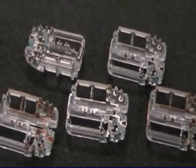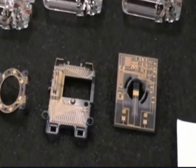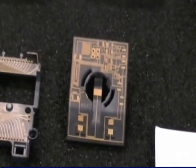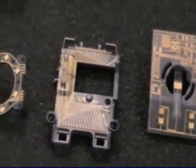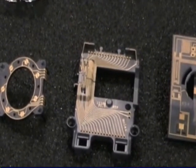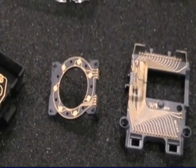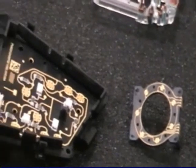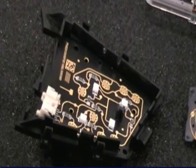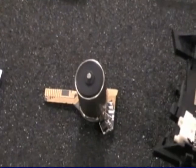As we look closer, we see some other three-dimensional molded interconnects, and these interconnects actually have a top layer of gold, so they look brighter than the insulin pumps. But these are some more populated, more dense circuitry that are put onto a wide range of plastics to be able to carry circuits and integrated circuits for functionality. The plastics range from ABS-PC to PBT and liquid crystal polymers.